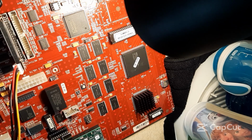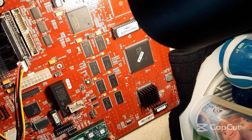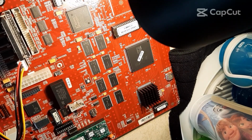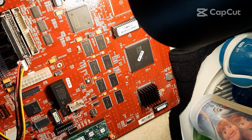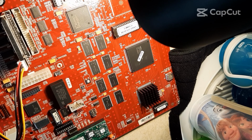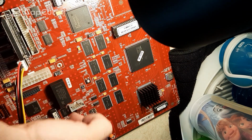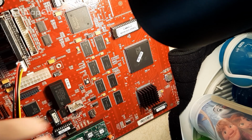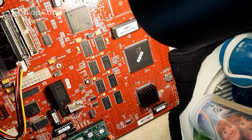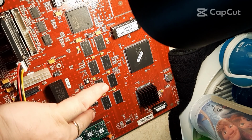So this U53 chip is out. And it says, where is it? Well, there it is. I put it in this foam little package. Okay, so the dent is up here on this end, so that's which way the chip notch goes. Chip notch. Started. Yep. Feels a bit tight. Okay.